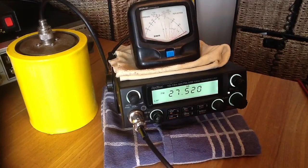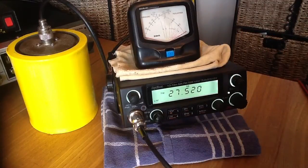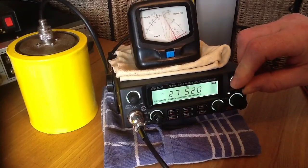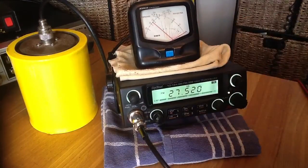Optima 3, here we are on the FM setting, low power, standard microphone, just under 2 watts. Increase up to about 30, switch the meter to the high power setting — 50 watts on FM.